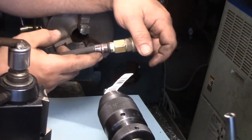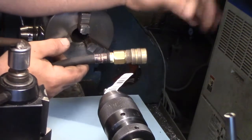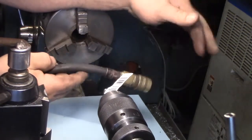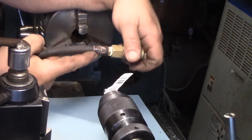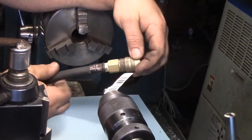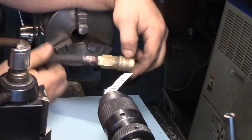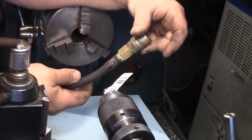These things aren't expensive. It's like $3-4 for a pack of 10 of these. And I said, Ed, you got all that crap, make your own. Yeah, but I don't have blocks of copper lying around or copper tubing of a suitable material. The copper piping you get in the stores is typically hard drawn, and it's a lot thinner. This is pretty thick ferrules here. They're twice as thick as standard copper piping. The soft copper, like the lines you unroll, maybe. But I didn't want to buy a whole roll for this until I figured out whether what I'm doing here is going to work. So this is going to get tried out and take a beating, and we'll see what happens. When it explodes, you'll hear me cussing about it on another video.